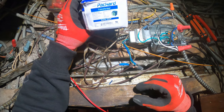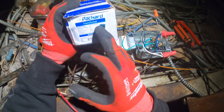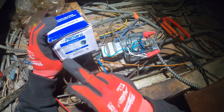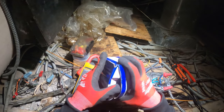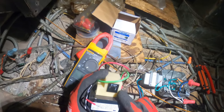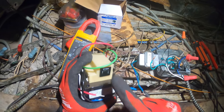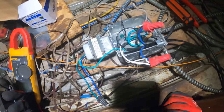So here's a brand new transformer — it's actually universal. Your primary can be 120, 208, 240, or 480. Our secondary is 24 volts. The output VA rating is 75; the old one was 40, so we're stepping it up. And over here for the low side, we have a 3.2-amp breaker, so if it ever trips you can reset it instead of the transformer going bad.